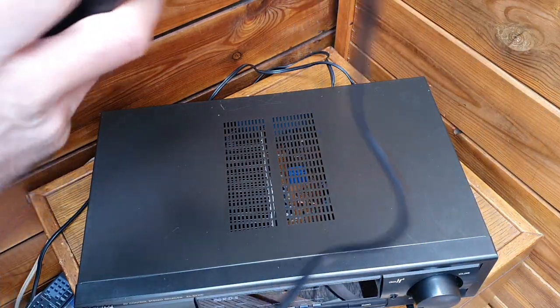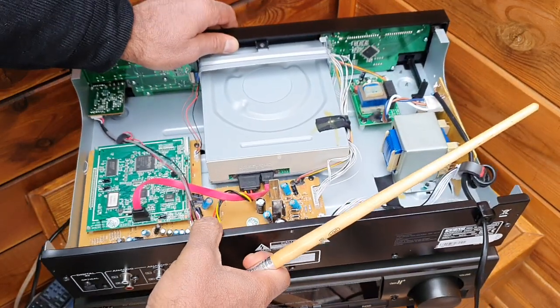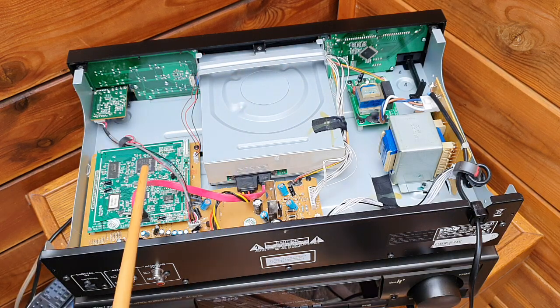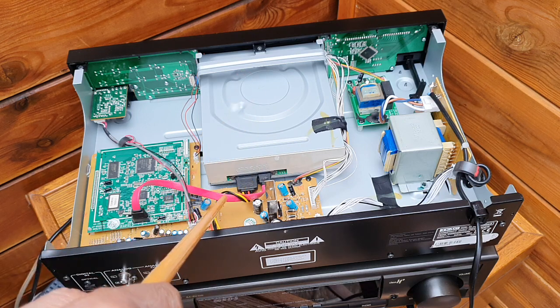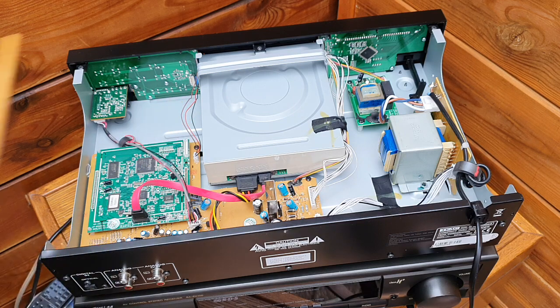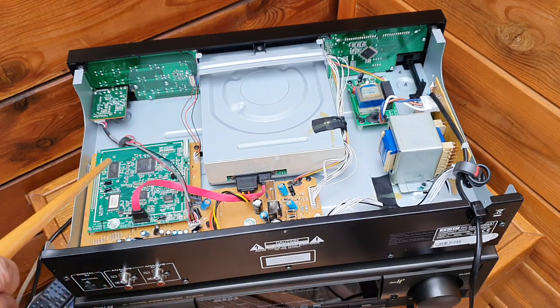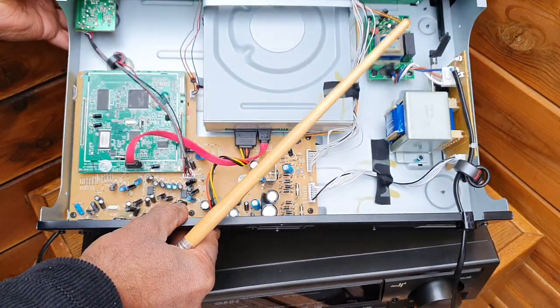No, there is no name, but several companies are making them. Toshiba and a lot of other companies make these DVD/CD drives, which are in desktop computers. So you just give it power, then you have a SATA cable, you already have input and output, and then you process it and convert it into an analog signal, and you amplify here.